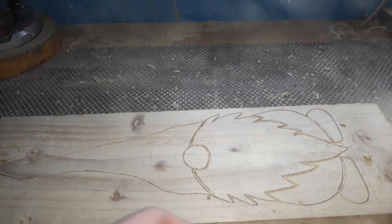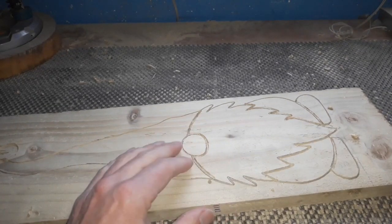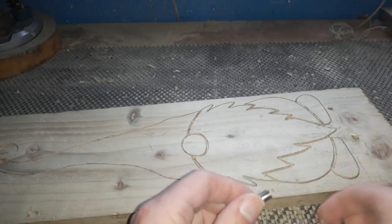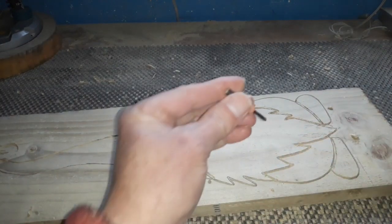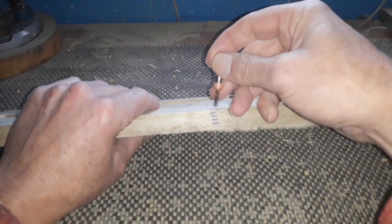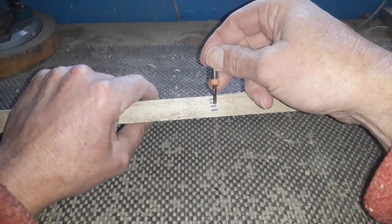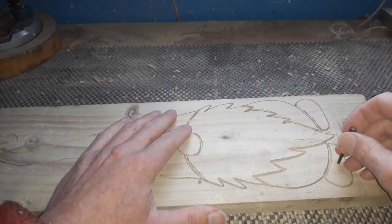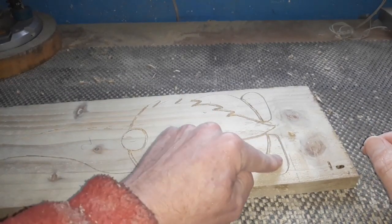We'll set this end milling bit, if I can just find it, this one here. We're going to go for the biggest of the lot, pop that into the adapter like so. Literally just slots in up to that barrier thing, and then we'll set it to our depth. Now this is going to be too deep for these, seriously. That's far too deep, is that? So we'll start off halfway down, clear out the shoe, and then we can lower it and just keep lowering it down till we get to the desired depth.